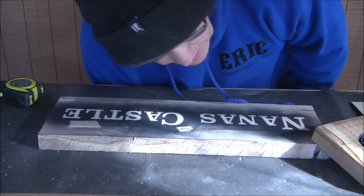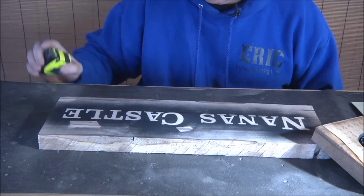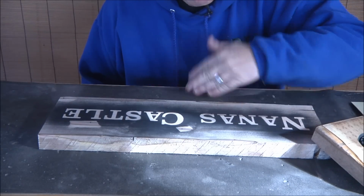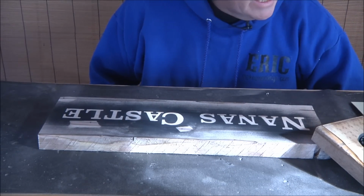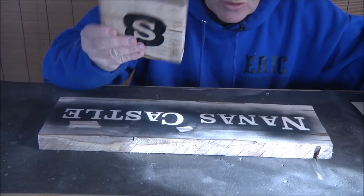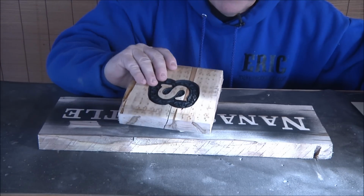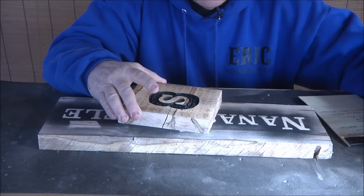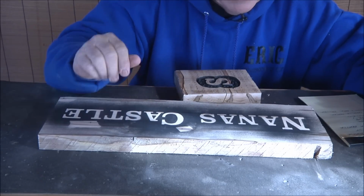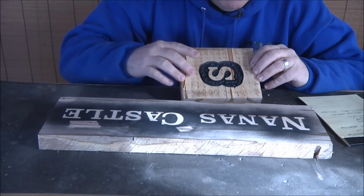It's very heavy. This has got quite a bit of moisture in it. Some places I measured it, it's like 16. Some places it's less than that. I'm excited to give it a try on a bigger board. Again, my first impression was heavy. This is actually considered a softwood, but man, it doesn't feel like it. It sanded very hard. That's why this piece here, I just ran through my planer, and I got down below the stuff it seemed to have.